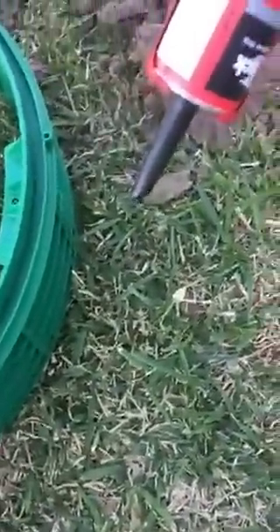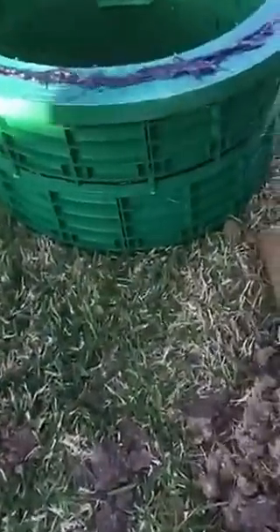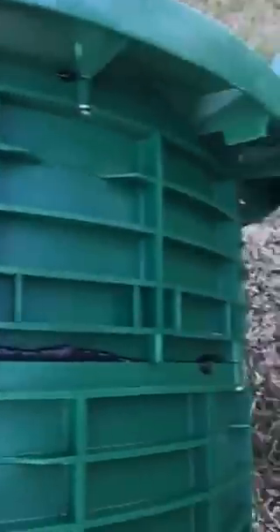In this little groove here — because there's no gasket and you don't want water infiltrating — we put some Henry's roofing tar in there with a caulk gun, just like that. It ends up looking something like this. This one's all put together and ready to rock and roll. It's all sealed up and you won't have any water infiltration.